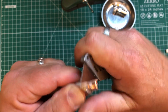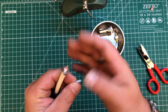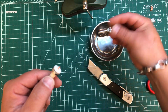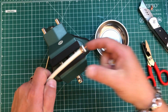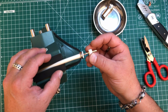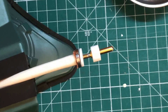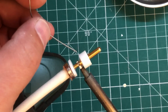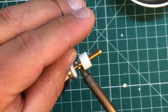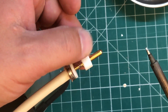Sometimes a knife helps. Then we take this little washer and slide it over the center conductor. We're going to solder the center conductor back on. I really like putting this in a vise — it gives you a helping hand. We slide it over and I like to keep that hole up because we can feed our solder through there and just heat this up. It's going to take a little while. There it goes — just like that.